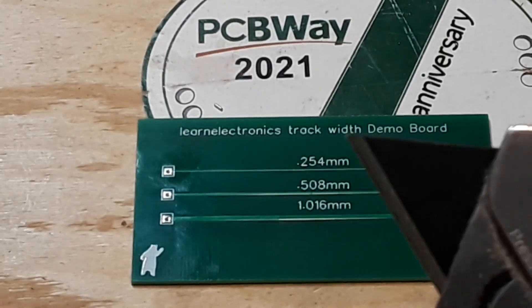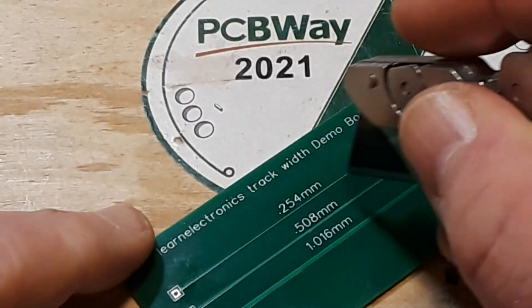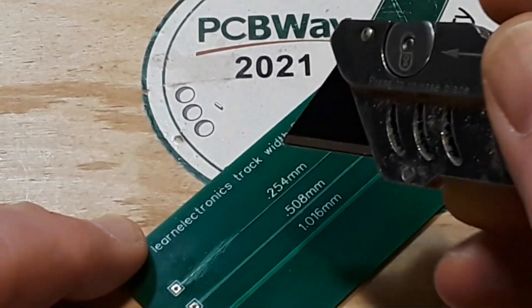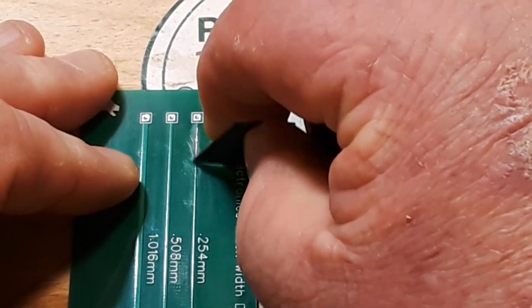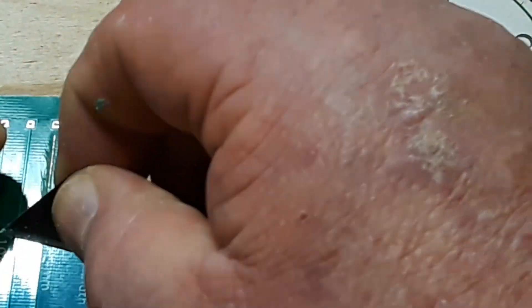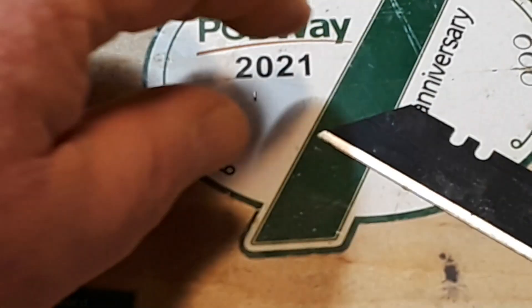Like I said, I have always been a scraper. So I've got a brand new blade here in the box cutter. I might even take it out of the box — come see. But this is the way I've always done it, just scraping. And you can see it's a pretty effective tactic for removing the solder mask. We're getting down there so we can see the copper. The idea here is just to scrape and not to dig. So that's method number one.